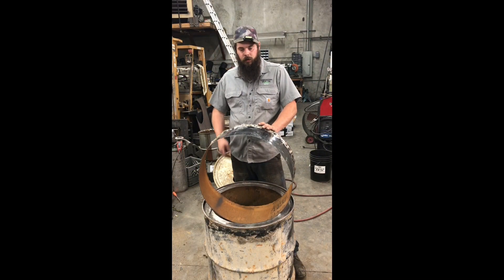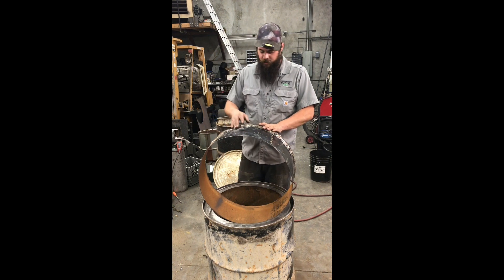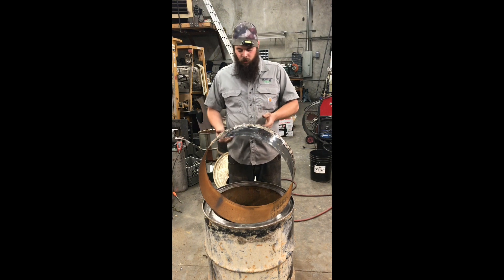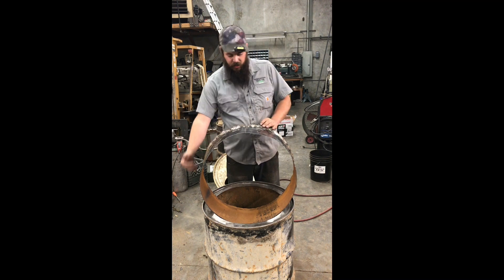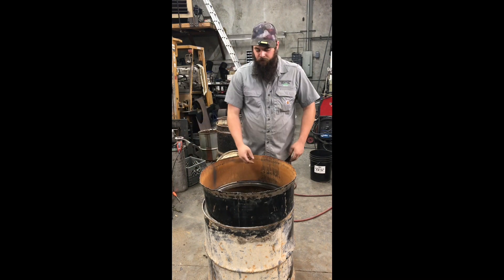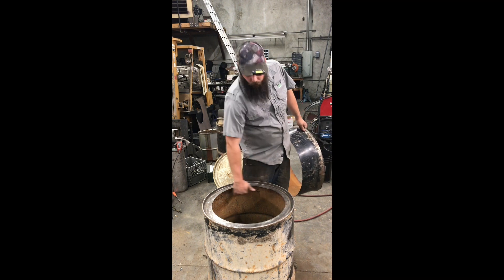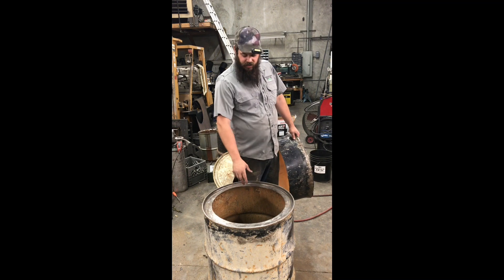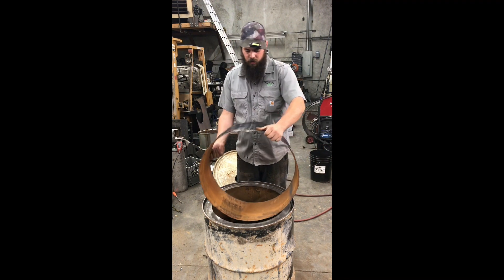Remember the eight-inch rip that we took out of the bottom barrel? That's why we don't throw anything away from the barrels while we're building — you can always use it later. I'm going to take it over to the sawhorses, beat this flange, and just pull it halfway straight. Then I'll buzz it in half right at the factory seam. Because this is eight inches wide, I'll make a centerline at four inches all the way around. We'll take this cut edge, overlap it, and sink it through that hole. That's going to start a vertical wall which will end up being our bottom water gutter. What's left at the top, we'll split every couple of inches — just like we did on the fire tube — fold those fins in, and that creates the funnel for the wood to pass through to hit the fire tube. I'm also going to cut some little notches in here to add a little bit of air circulation that can get into the hopper and help it condense, and get a little more heat in there to keep the tar liquid so it can drain out better.